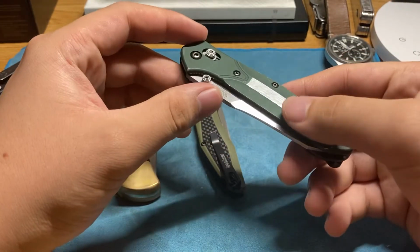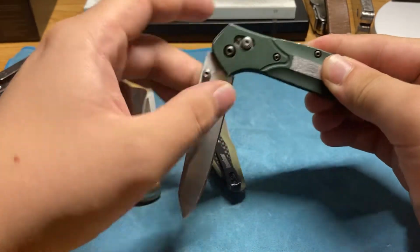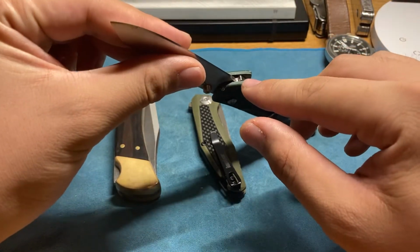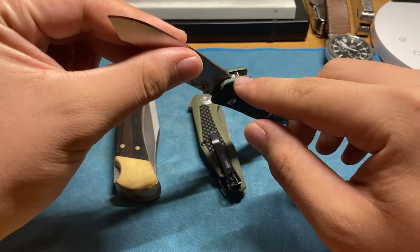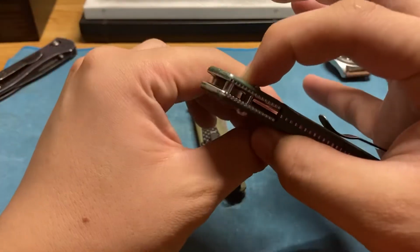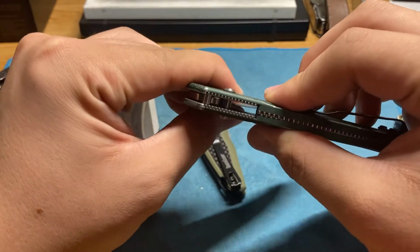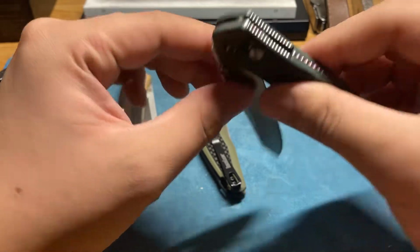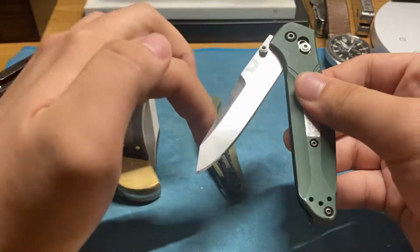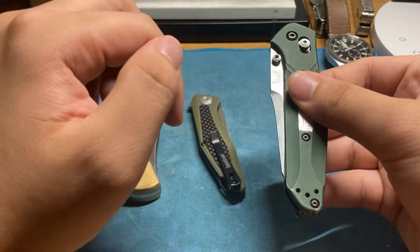So it arises from the structure of the knife. Again, the axis lock has it by pushing against an angled part of the tang. As you can see down there, that little hook is what creates the detent, because the crossbar needs to overcome that hook in order to open the knife. You can see it in here. That hook forces the bar down. But once the blade gets past that hook, the blade is not going to be sucked back in. But once you get past it the other way, the springs of the lock pull the blade back in.